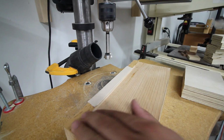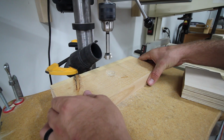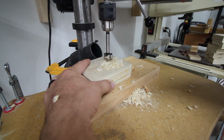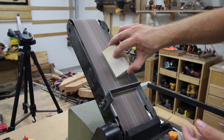Using double-sided sticky tape, I put a small shim on a sacrificial board, ensuring each conduit had close to a 5-degree incline to help prevent the clamps from sliding off. The conduit I'm using is 3/4 inch, but the outside diameter is 15/16. Most drill bit sets won't include a bit this size, so I will include a link in the description.